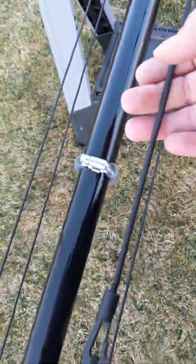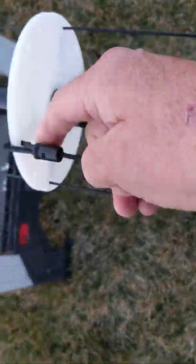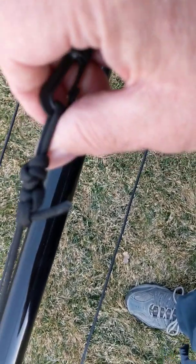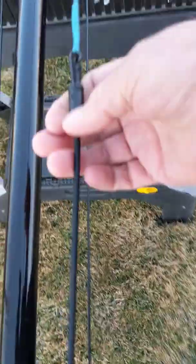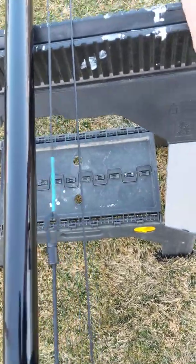The rest of it was pretty well explained. The 17 meter was shorter — comes up here, so I've got a longer piece of paracord on it from the 17 meter that comes back down to here. I just tied a little knot in there to hook to the clamp — a little clampy — and then about a foot-long piece of shock cord, and that's where the 17 meter element hooks.